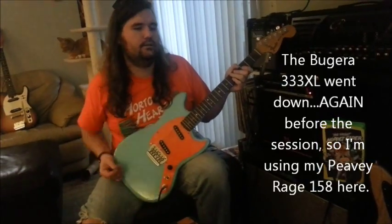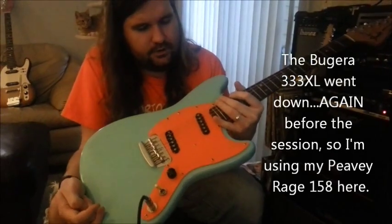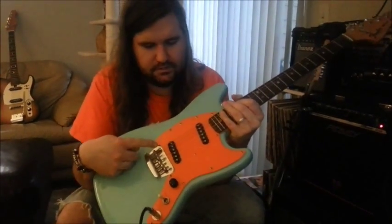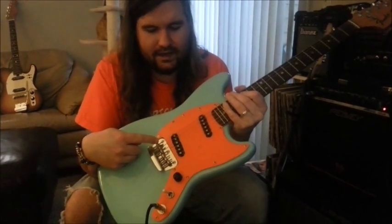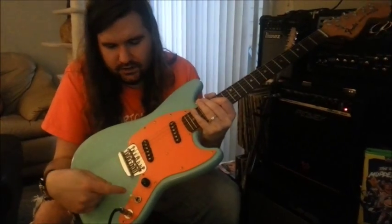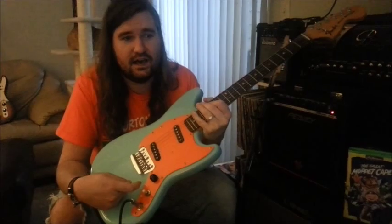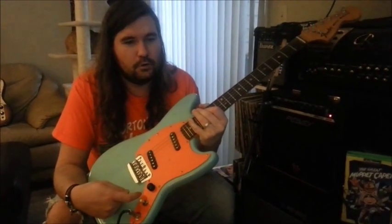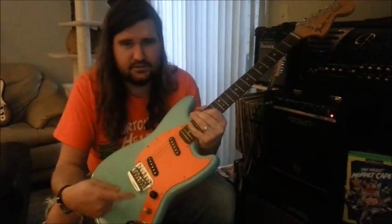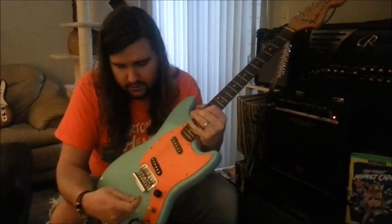And we are back again with this thing fully assembled. In the neck position, we have a Washburn MG45 single coil. In the bridge, we have my neodymium magnet equipped Harmony single coil that I pieced together. And then I have a three-way switch to switch between pickups. The middle position is kind of an interesting out of phase, forward polarity kind of position that both cuts the hum, but at the same time gives it kind of a halfway between a regular in-phase and out-of-phase sound.